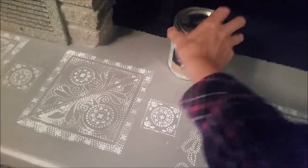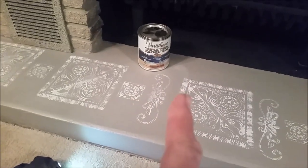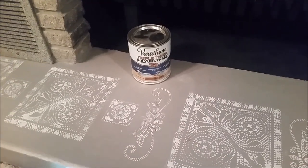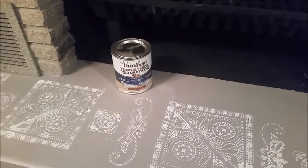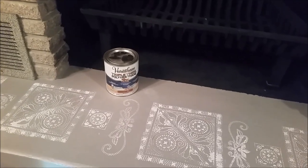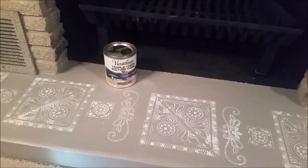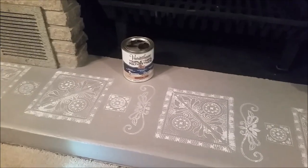And because I'm sanding it, I'm gonna go ahead and seal it with the triple thick polyurethane. And this is just some Varathane that I had on hand. Generally, I always buy Minwax products for stain and for varnishes. I used Varathane once on a wood floor and it just peeled right up. I don't know if it was just that there wasn't enough sanding in between layers, but that floor was a total fail, and later on the whole thing got covered with carpet. So, you know, another one of those hindsights.